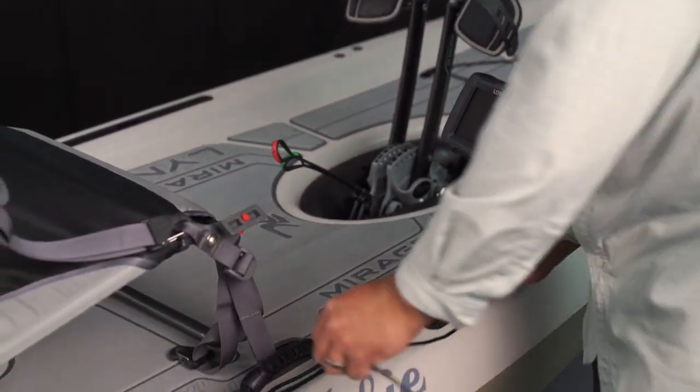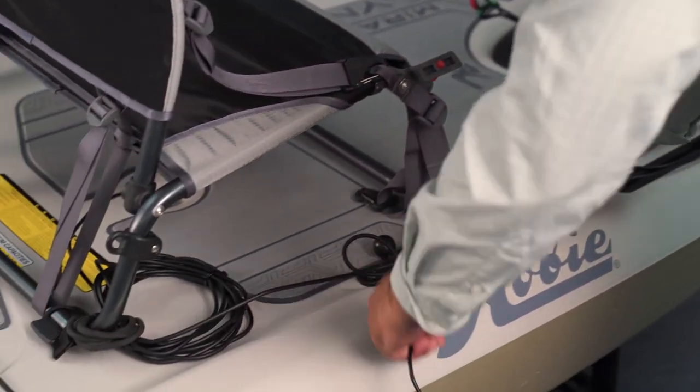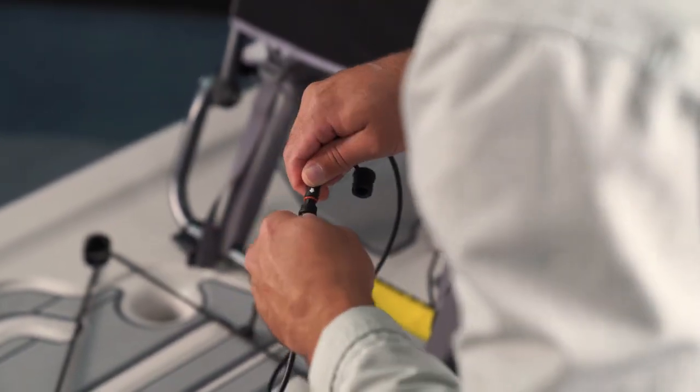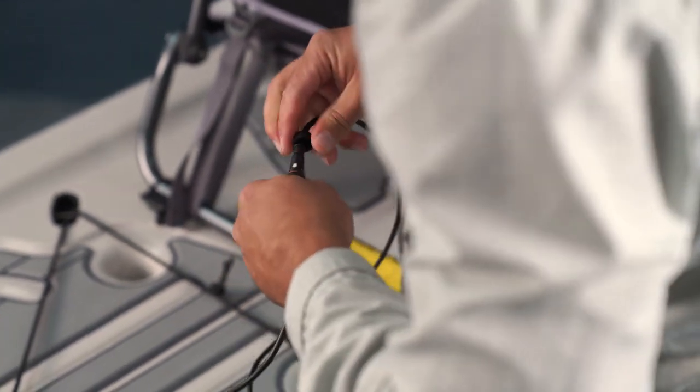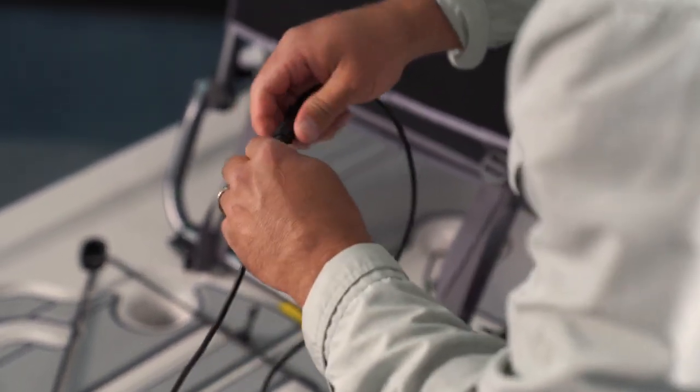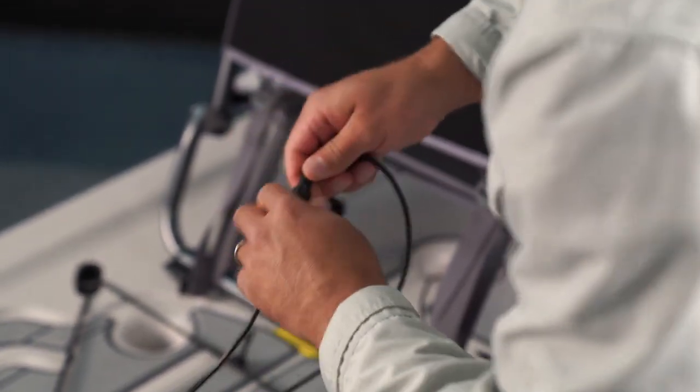So we're plugged in there. We can tie into these same nylon ties at the handle and at the back of the seat. Make sure the two tabs align on the male and female end of the Nakwa plug. And then just tighten that cap down. That's going to compress the gasket and get you a nice seal on that plug end. And then I'm just going to put everything right in the seat back pouch there.